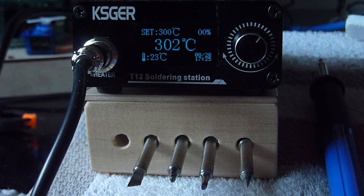All in all, this is quite convenient with quite useful functions. Especially the standby, which is perfect for prolonging your tip life. With your current station it happens quite frequently that you turn it on, have it on for two hours, but your net soldering time has only been a couple of minutes. This unit prevents that — if you set the standby time to a couple of minutes it prolongs your tip life and saves some energy of course.